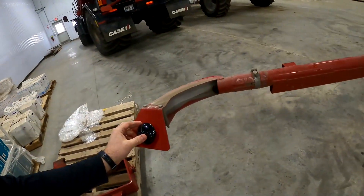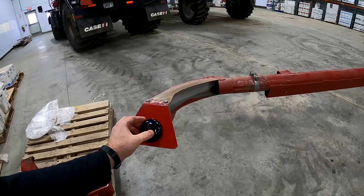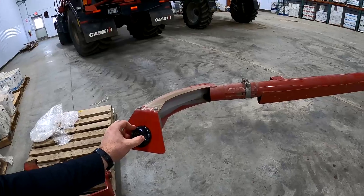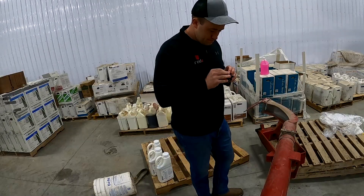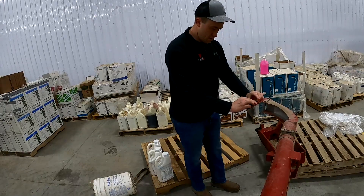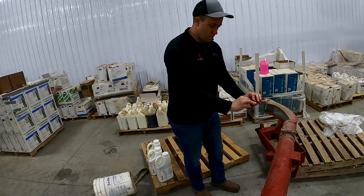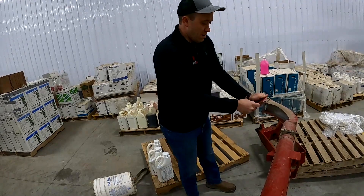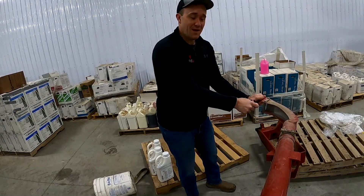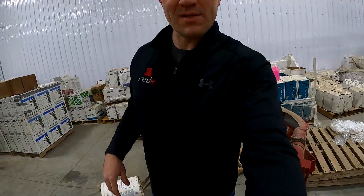It's pretty simple on how to put this on there. You just take off this VHB backing for the VHB tape, then you center it best you can on the sensor and you stick her down. Make sure you push down hard on that thing because otherwise it's not going to stick. Stick it on your deflector, center it up as best you can, and give it a hard push to activate that pressure-sensitive adhesive — PSA. Now you can watch me put the rest of them on.